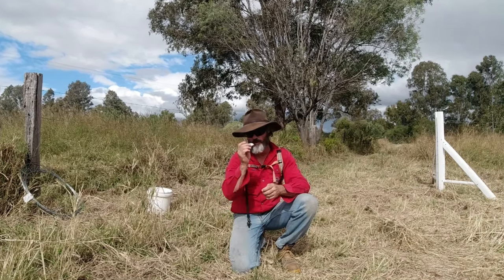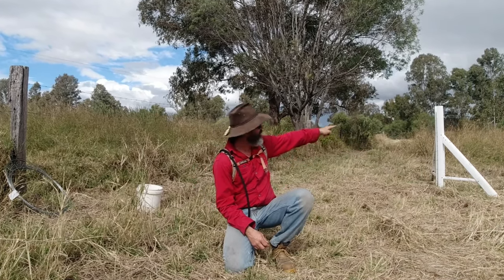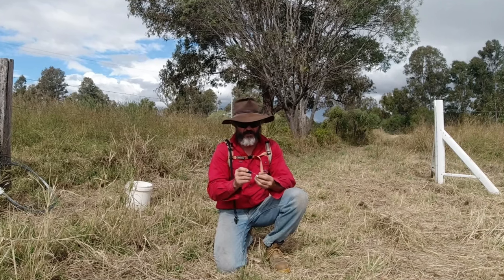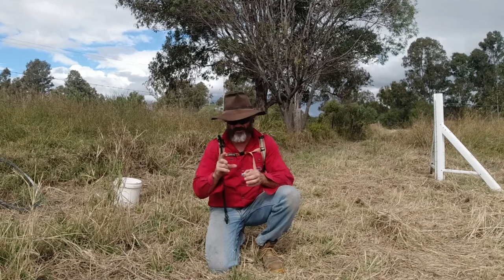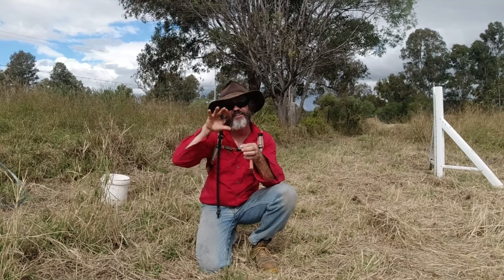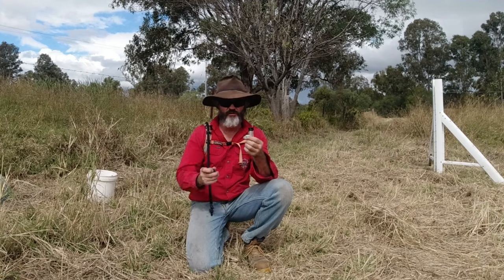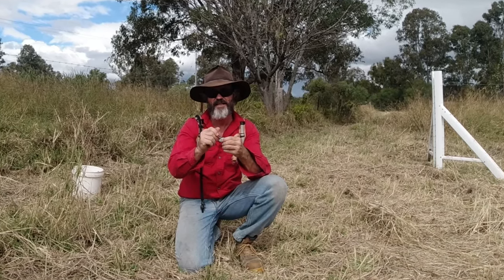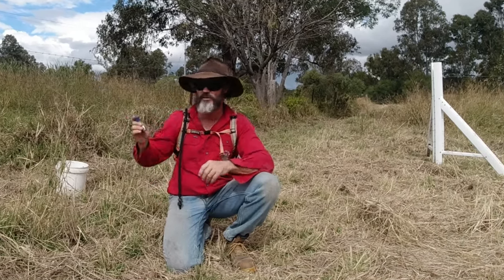What I'm going to use is a gripple. The reason I like gripples is because it's only a temporary fence — the tails on those plain wires there, with the gripple tool which comes with the gripple pack, you just push it in and you can unlock it and slide the wires off. If you've got a permanent joiner that uses the clamping mechanism to join, you need to then cut that wire. But with that simple gripple tool, straight in with the tool, push it in until it clicks and then just pull the two wires out. And you can reuse that gripple and also reuse the wire.